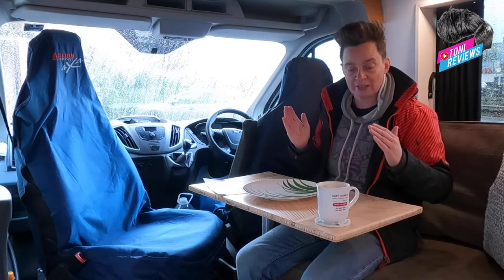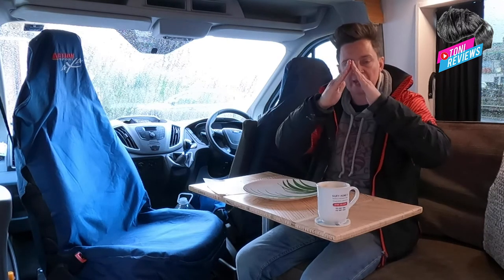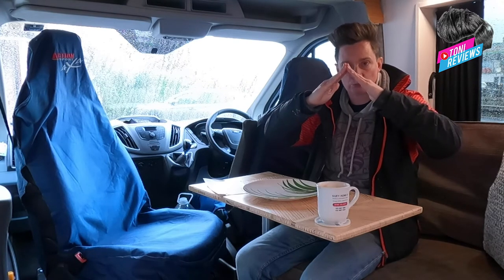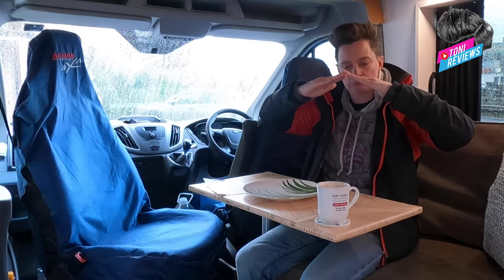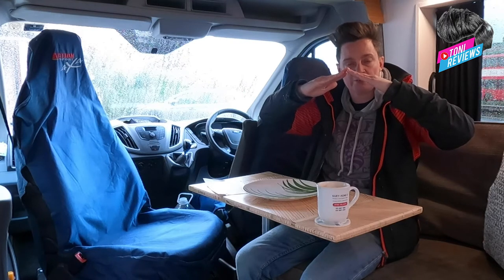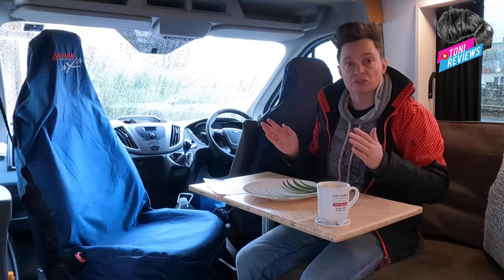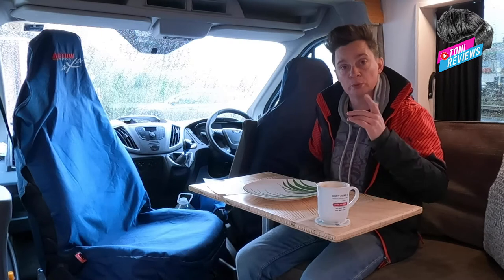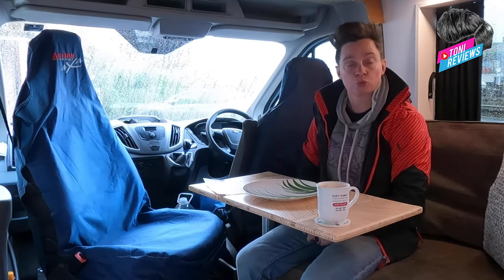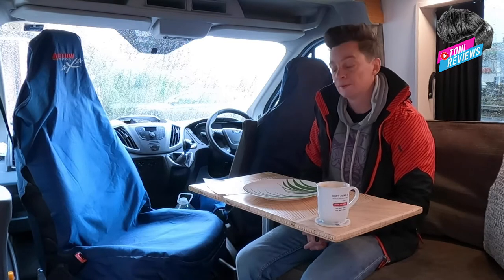So I reduced the angle down to probably 15 or 20 mil. So instead of getting a 90 degree triangle top, like in my pattern, it's more of a 30 degree or 25 degree angle, which isn't a problem, but you're limited to how much of an angle you can get on your ply and how far you can do that out. So you will need, if you can get your hands on more than two sash clamps, you can do it, but ideally use four.